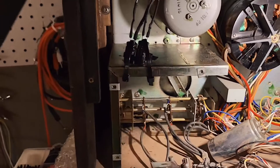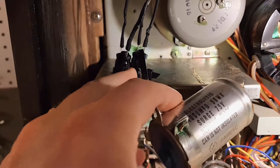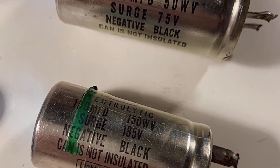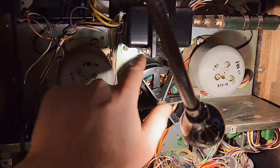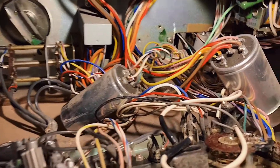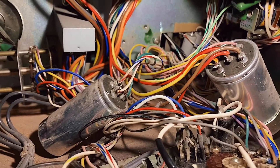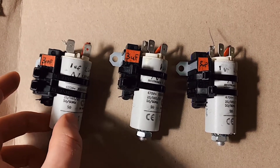These cans are now so much smaller. This is one of the cans that was replaced — see how much smaller it is. Same value, just crazy. This is a 1 and a 2.8; couldn't find a 2.8 so I'm using a 3. And this is two 3s and 2 watts. I was able to find the 3s. Funny thing is, since they don't make these cans anymore, I had to sort of make my own — I tied a 3 to a 1 for each.